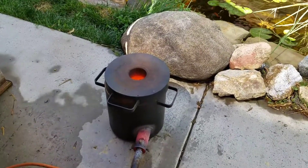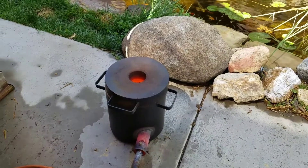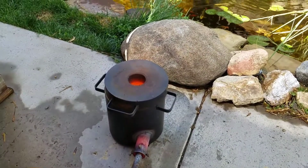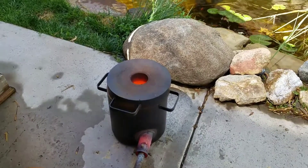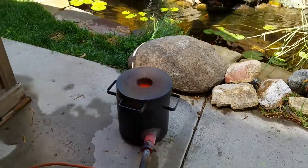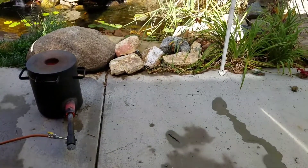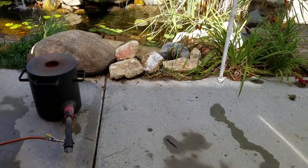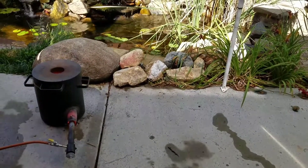Copper inside is in a crucible — it's a 12-pound crucible. It takes about 45 minutes before the first batch is molten enough to pour in more copper. Later we're going to throw it onto steel. I have different ladle sizes that we pour the molten copper onto to create all the effects.